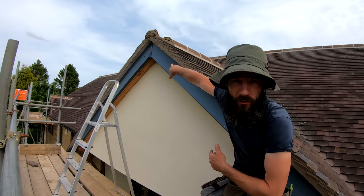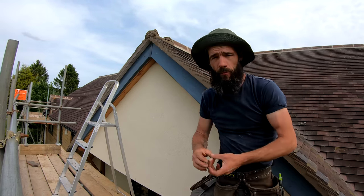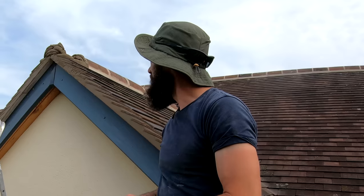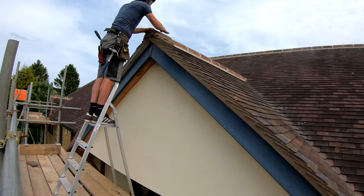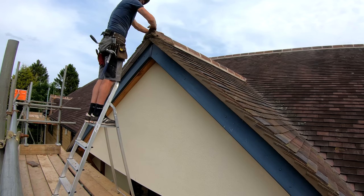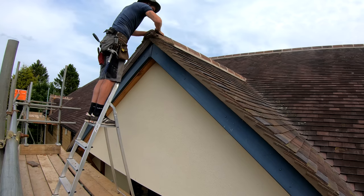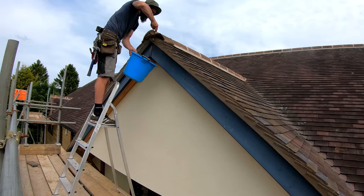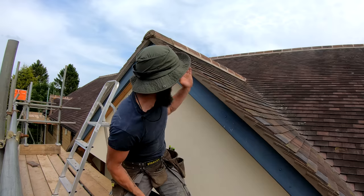This is what's happening — got this up, got a little bit to point there. What we're gonna do is you can see I've got all that muck up there with lots of tiles in, and then we're gonna get this lovely little diamond bit of tile that Jay's just cut for us and stick that in the end like you've seen on the other ridges around the side. I've just got to keep patting it down so it's all level through here. That'll put a lot of muck in there. Get the bucket and trowel, scrape these sides off. I'm just gonna cast my eyes down it to make sure it's straight.